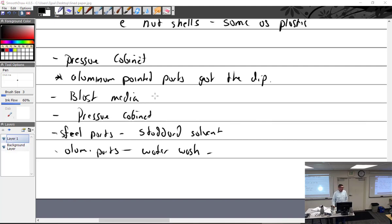We're talking about the dangers of blast cabinets. I told you a story about somebody who came back with a handful of plastic pellets — all green. Where did the green come from? Zyglo green. Somebody had blasted the crankcase, didn't pull those little plugs out. They got in the oil gallery, packed inside the oil tubes, and when the engine started up it flushed them all out into the system — not a good thing.